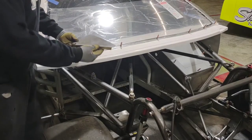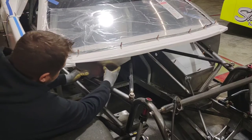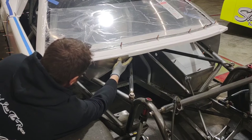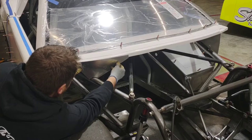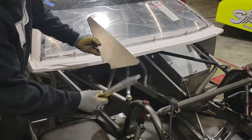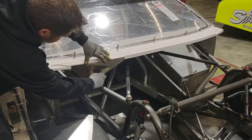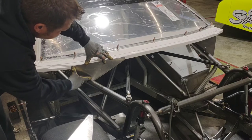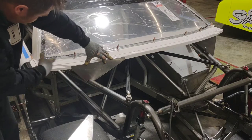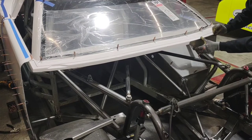Here is the first of the two — I've now got my tabs tack welded on. Let's see how she lines up. That doesn't look too bad at all. I just have to mark them, drill the hole in them, get them exactly where I want, and then I'm ready to cleco. I love it — awesome.